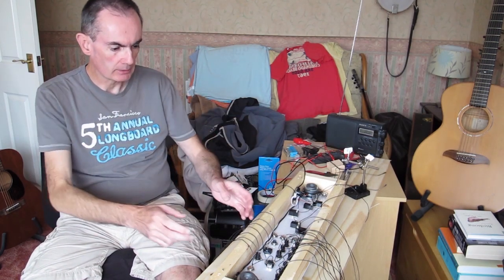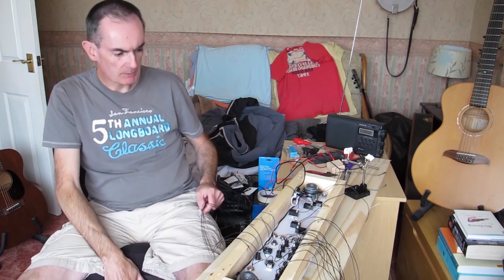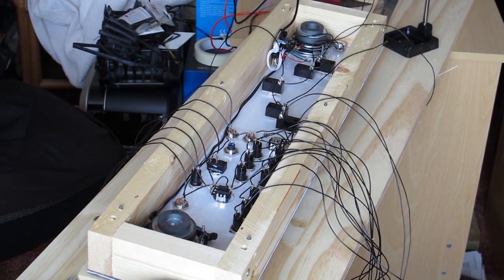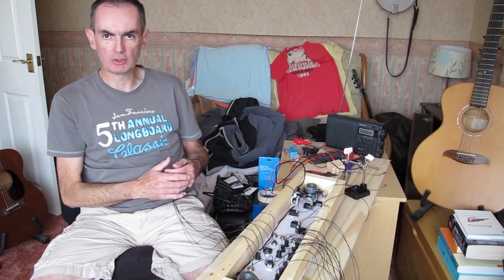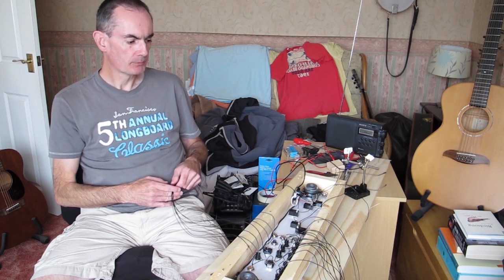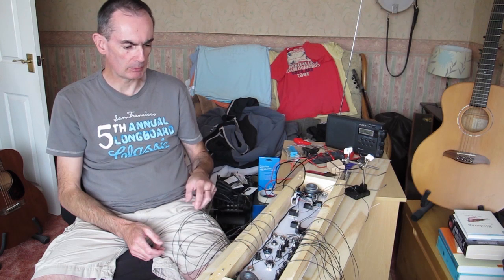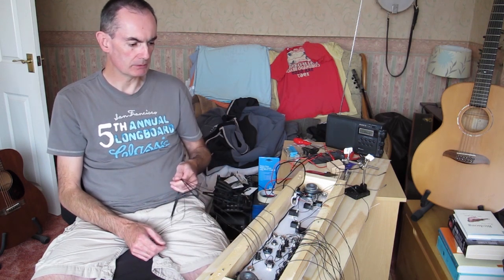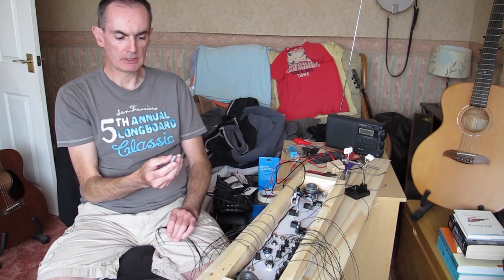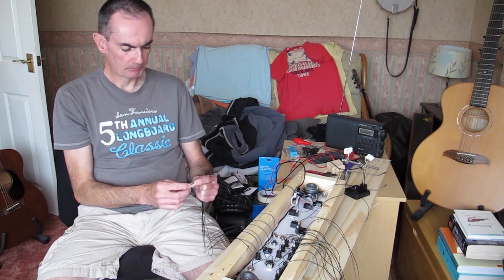Well, the soldering for the first panel — I was about to say it's complete. It's at a very specific stage. These wires are all now soldered onto the switches, and I could in theory just strip the ends of these and feed them straight into the Bodnar board, although the length I've cut these to would be impractical given where I've mounted the Bodnar boards. But I'm not planning to do that anyway, because I want this panel to be detachable so I can take it out and work on it. So I've got to basically do all those solder connections over again onto one of these — this is a standard 25-way D-type RS232 style connector. I haven't tried soldering onto this yet; it's a bit cramped, but they've got these little buckets. Should be doable.